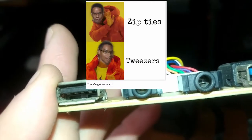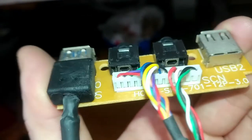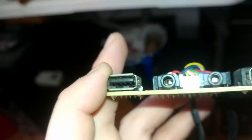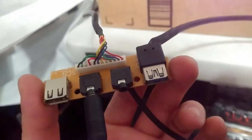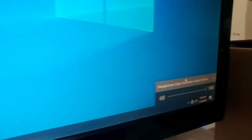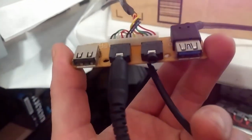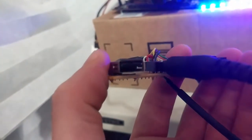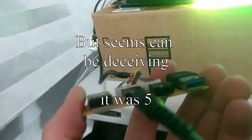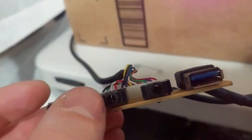I can see that metal where it makes contact. I'm thinking maybe it was pushed in a little too far, so I took a tweezer and tried to push it back out a little bit from behind. I'm gonna test it out right now — it's not really working any better, it's pretty sporadic. If I move it slightly, yeah, see, it goes away. I really don't want to desolder this; there's only three contact points.